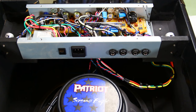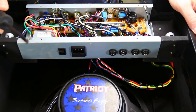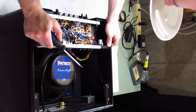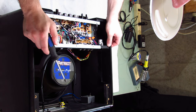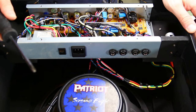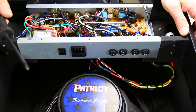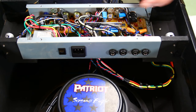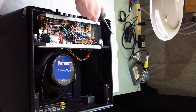One other cool thing about low voltage tubes and low voltage tube circuits is you really don't have to worry about, say, any high voltage filter capacitors, and it's pretty much safe to work on after it's powered off. I mean, when I'm developing circuits on breadboard, I'm just using 12 volts and plug and play different components as I'm working on it. Not even a big deal. Can't even feel it.